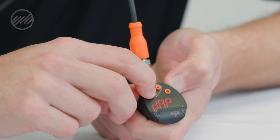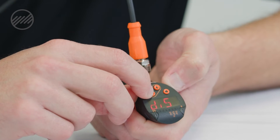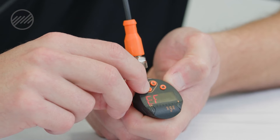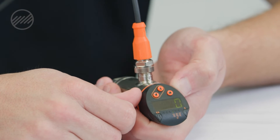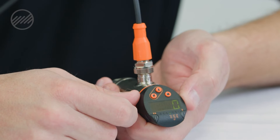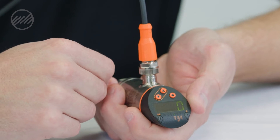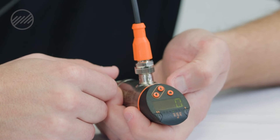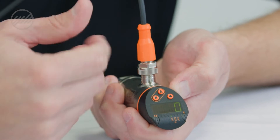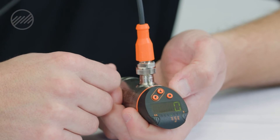You can use your down arrow to get back out of this menu, or if you wait a period of time it will take you back to the main display. Now you can see my orientation has changed, my color is green, we've selected PSI, and we've kept this set as a PNP switch.